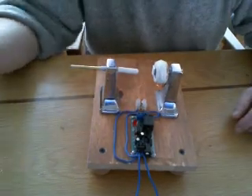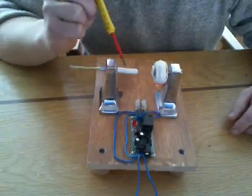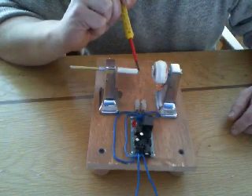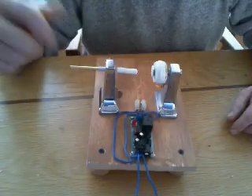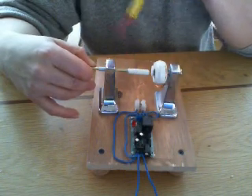What I used was a couple of little NEOs, a centimeter by 0.5, and 15 one-centimeter by 0.2-centimeter thick discs. Here you've got a four-millimeter brass bar and there's a bit of six-millimeter plastic tube. Inside here, where you can see the screwdriver pointing to, that's the 0.5cm by 1cm neo bar magnet. It's rammed into the plastic tube, and then the plastic tube is fitted onto the end of the brass bar, and that gives me a slider.